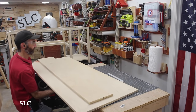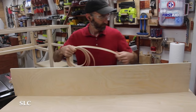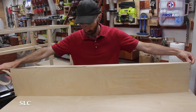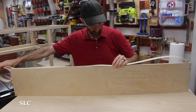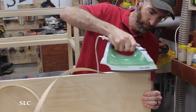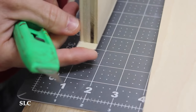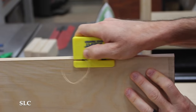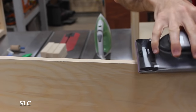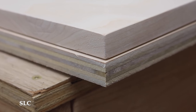It was now time to add a little extra care to the edges of the plywood by adding some edge banding around all three pieces — this will allow the plywood to look so much better. Since the plywood was birch, the edge banding needed to be the same type of wood so that the stain would look similar. The great thing about edge banding is that it can easily be applied with a standard clothes iron. It can be trimmed to length with a razor blade and the sides trimmed with an edge trimmer, followed by some light sanding with a fine-grit paper. And as you can see, the edge banding makes a big difference.